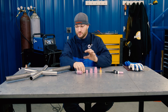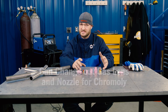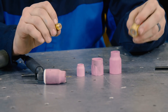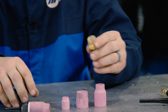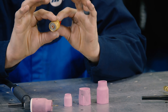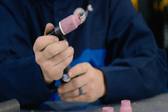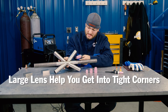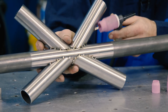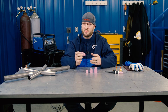Another thing I'm changing out for chromoly is going to a gas lens over a regular nozzle. You have a small lens and a large lens option, fairly standard at any weld supply store. I always go for the large lens. It might seem a little spooky when it comes to size, but because of the diameter of the shield gas coming out of the nozzle, I'm able to hang out my tungsten quite a bit farther than I would on a normal lens. That allows you to get into tight corners without any trouble. You get way better coverage, it's way easier, and you have a little bit more to grip so you have more control.